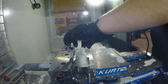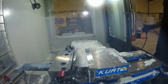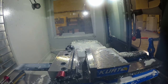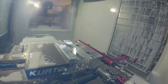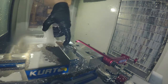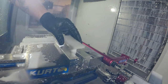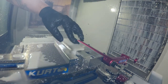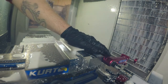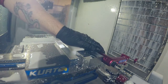I'm going to flip it over and put it in some soft jaws and deck the backside off, completing it. This and this and this align the part. The hole I'm pointing to here is the XY0 of the soft jaws — put it off to the side and it'll squeeze itself right where it needs to be. It doesn't really matter so much because all we're doing is decking off the back.